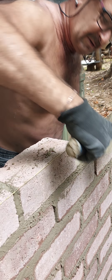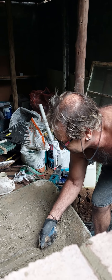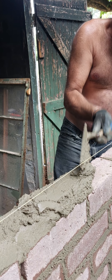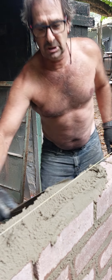Clean it away there, and on the inside the same — chuck it back in the barrow. Now I'm going to show you how to put some cement on the wall. Take a nice slice — see that? Look at that: neat and rectangular. Pull it all on, make it neat down there, put a little bit on top.